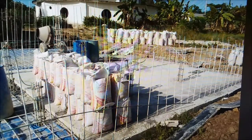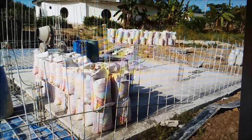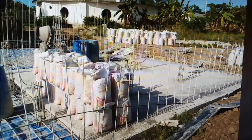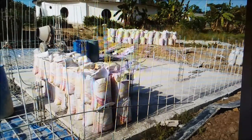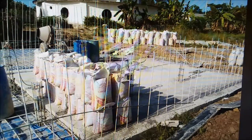There's still water in this barrel with the hose next to it. This is probably our next location for pouring, and they'll put in water barrels for the extra in case we need water. When they actually pour it, they may put a couple of empty barrels where these bags are, because these bags are going to be part of that floor. Then you scoop it out with a five-gallon bucket — 12 scoops to empty a barrel — dump it into an empty barrel and move it out of the way.